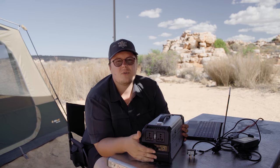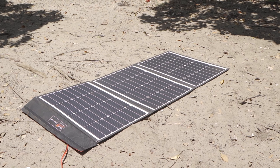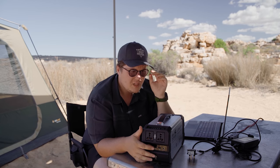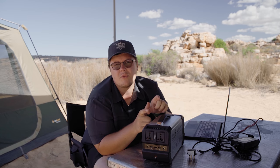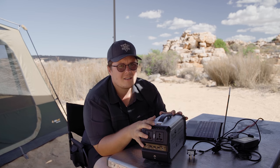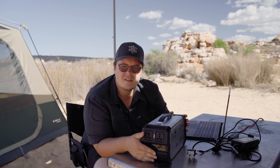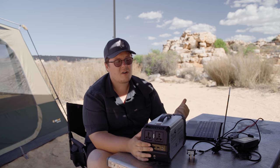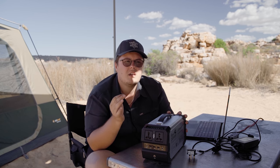Another issue with the input system is that it's limited to about 6.7 amps. On my other dual battery system - the National Luna system - I have a monitor and the MPPT solar input can tell you the amperage drawn from the solar panel. On a really bright sunny day that panel is pushing eight amps, so you wouldn't be able to fully utilize it with this pack. I might need those eight amps and it's only giving me six, limited by the system. I paid seven thousand seven hundred rand for that panel and I want to utilize every last milliamp.